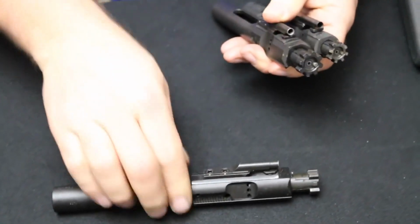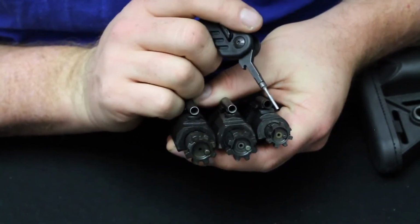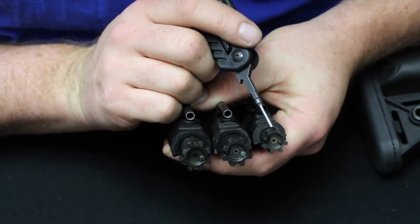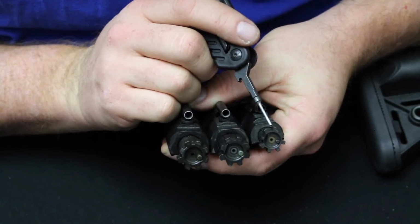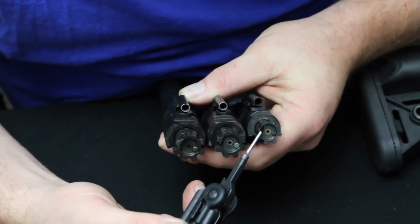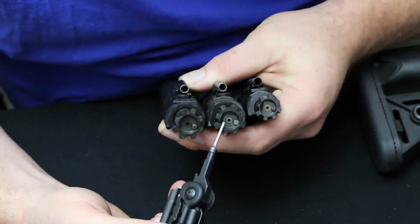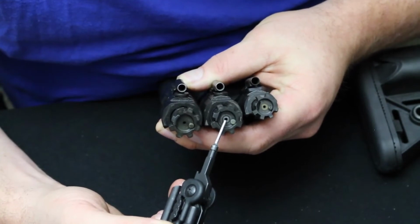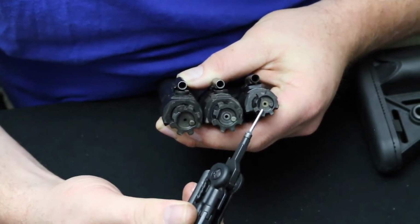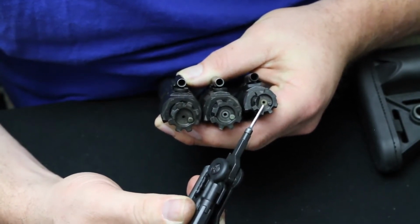The most important thing we're going to look at now is the bolts. Okay, shown here is an actual production 7.62x39mm bolt manufactured for an AR-15 M16 type conversion. Now you can see how thin these walls are right here. You don't have a lot of support on the sides at all. Next, we have the Anvil. This is a slightly different diameter, but you can still see this is a 5.56mm base bolt scaled up to take the 7.62x39 cartridge case.